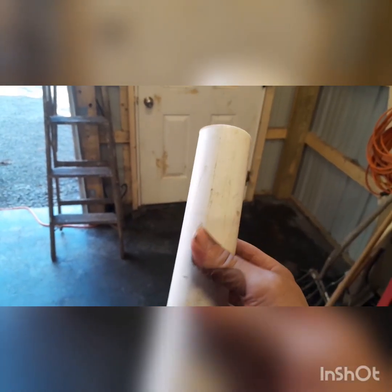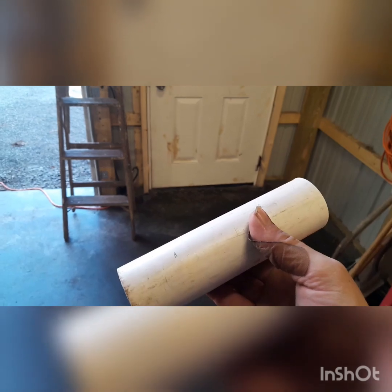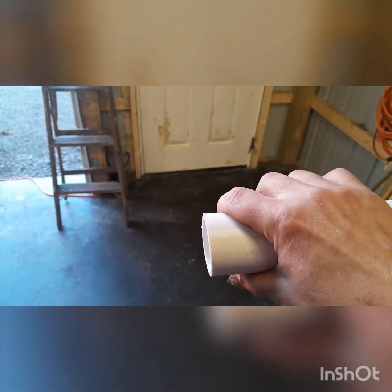If you don't know how to cut PVC pipe, it's pretty simple. You can get a hand saw or a reciprocating saw — that's what people call them. Get one with a metal blade that has a lot of teeth and it'll go through nice and easy. Don't use a wood blade — it'll just snag.